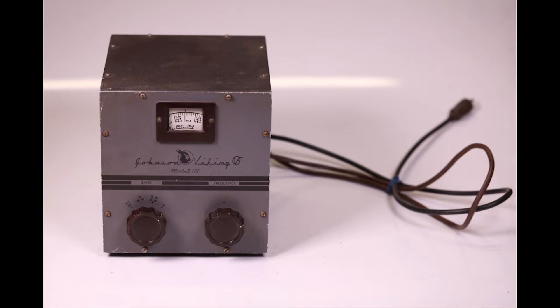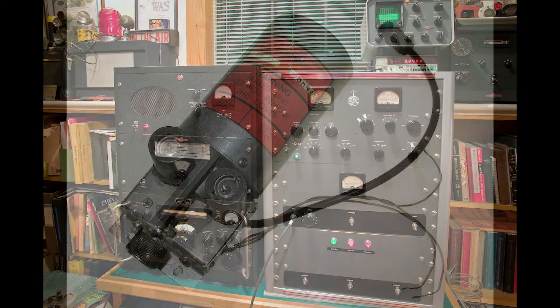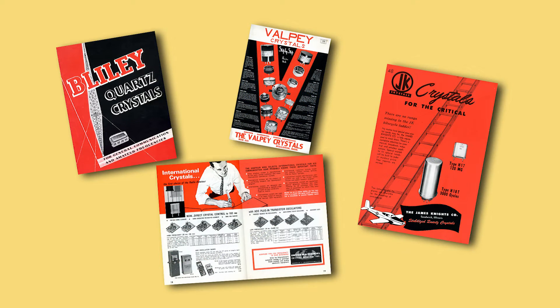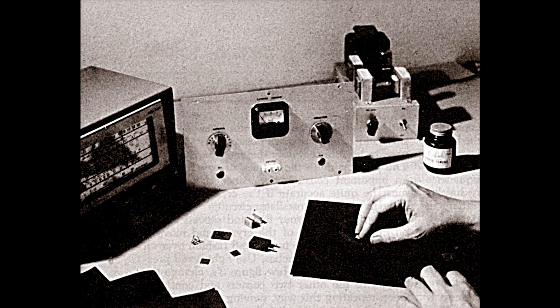In the world of today's operation on the amateur bands, most AM QSOs take place on a very few frequencies on the lower bands, making a VFO not really necessary. The availability of specific AM frequency crystals today is somewhat limited and often expensive. Other than grinding your own, we can seek a perhaps more modern alternative.